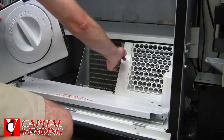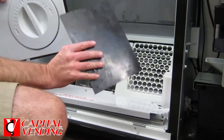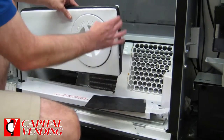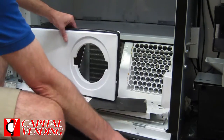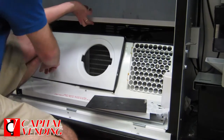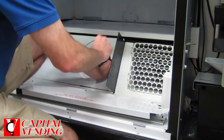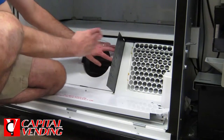I'm also going to take a bit of this and put it right here. I have this little guide that I'm using like a shoehorn — we have these, or you could use your own; it's a very inexpensive part. This makes the installation easier, and it's very important that when you're installing this you take your time, because you don't want to rip this gasket off. I lift this panel up, push it over to the left, and put this piece in about three-eighths of an inch — just enough so that this gasket right here doesn't get destroyed. I gently push this, and everything's in place. You can see the gasket has not been bent or folded, because I want a really good air seal here.